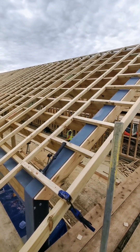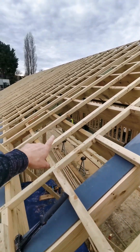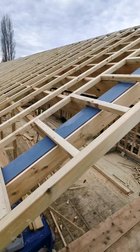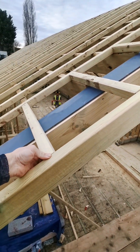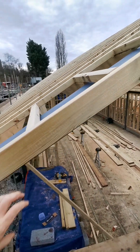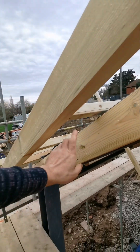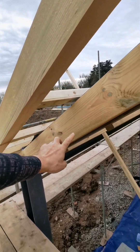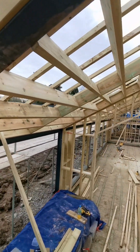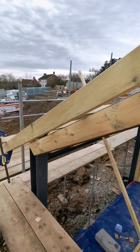Working on the ladders, a little bit different from usual. Joists, rafters — however you want to call them — with a two by two counter-batten for airflow. What we've done is run them long, going to tie them in with a bit of four by two, but we've ripped them down to the same thickness as two bits of two by two. Then we're going to put a four by one up to take the weight, another two by two to pick up the soffit, and lower the four by one in line with the underneath — to tie it in for the next phase of the build.